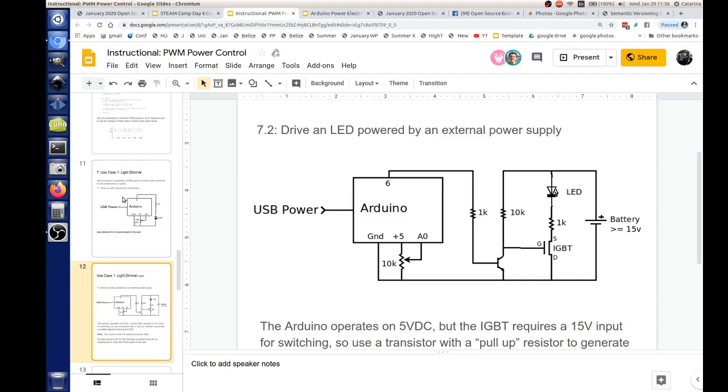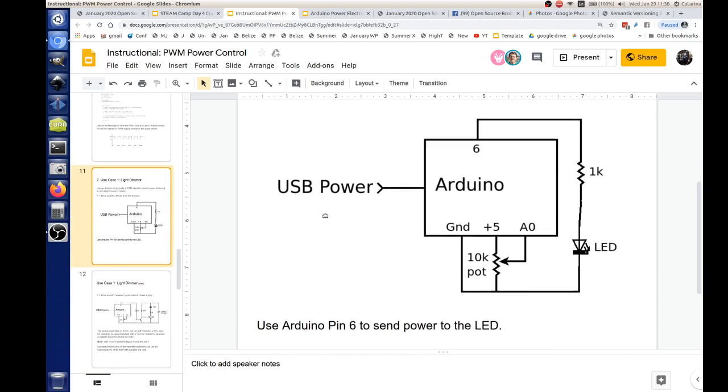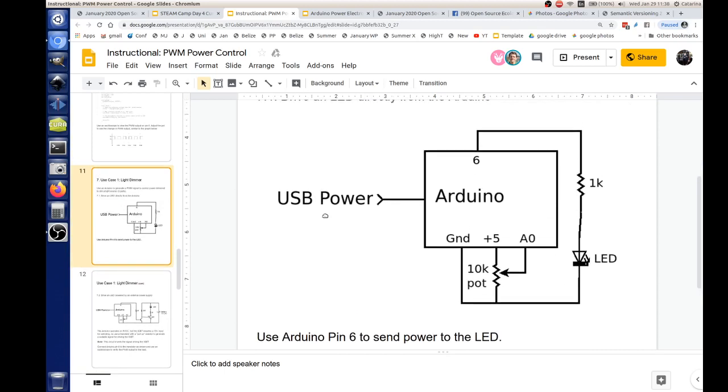If you put two resistors in parallel, would they reduce the effective resistance? Yes. So you could get this twice as bright. Say if you take a 1K resistor and put it in parallel with another 1K resistor, it basically gives you half that. You've got two paths, so it's double the current, which will basically give you half the resistance. And then if you take two resistors and put them in series, of course that'll double the resistance.